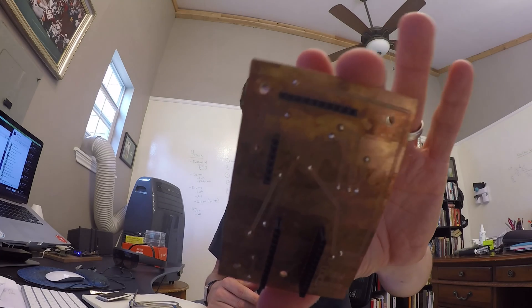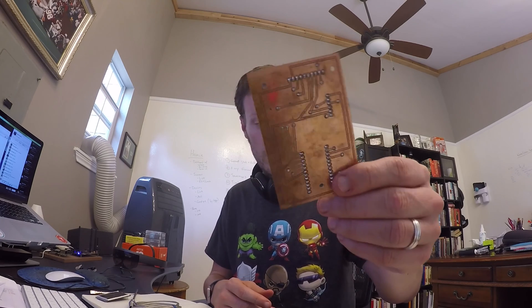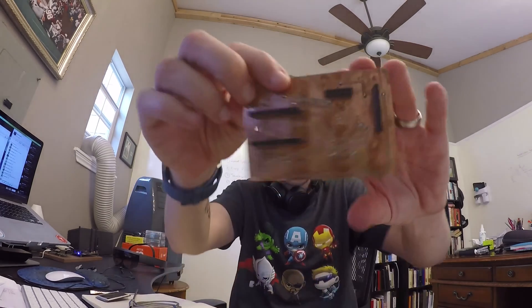All of this is on a custom PCB that I designed with Eagle and that I cut with my Othermill, which is a desktop CNC. I did all the soldering myself. There are a few tricks when you're building PCBs with the Othermill — for instance, all the electrical connections into the pins have to be on the bottom. So there's a ton of vias on this board.